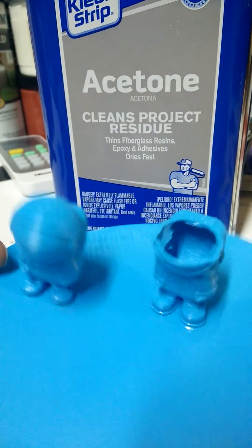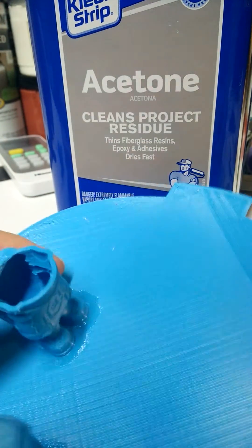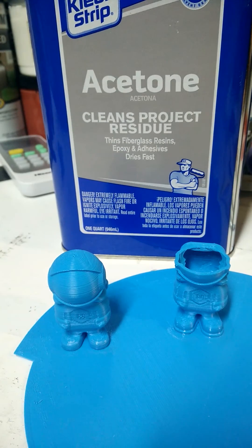So anyway, it's cool — you can glue it with acetone since you've already got the acetone anyway if you're going to be smoothing some stuff. It's a cool product. I don't have a brand name — it's a generic filament, got it on eBay for 20 bucks a roll. It's tough. It's a UV-stable version of ABS, so you can make a birdhouse out of it, stick it out in the sun, and you can make stuff for your car, which is what I'm ultimately going to be doing with it.